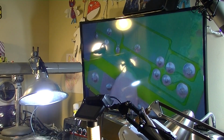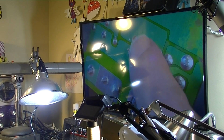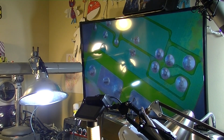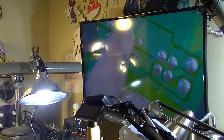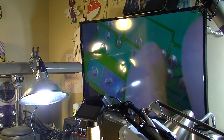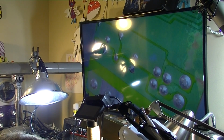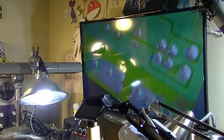Like I said, this whole power section down here is really suspect to me, and it looks like, ooh, this has been replaced before. See this? This capacitor has been replaced, and they even dropped some solder on the board right there. So I wonder if this was a problem sometime in the past. That's interesting. Let's see what's under here.